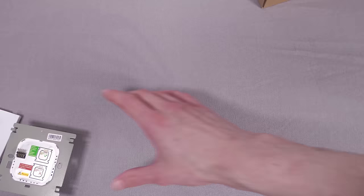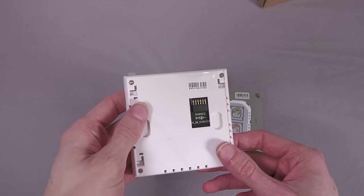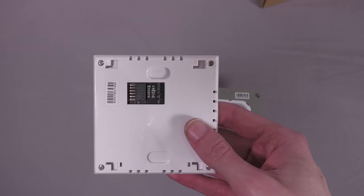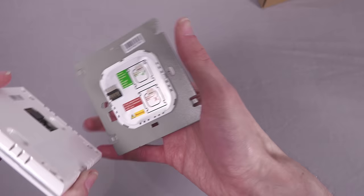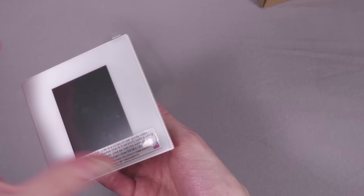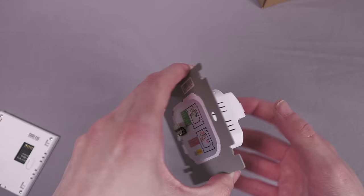Just get a couple of M3.5 screws — the standard screws that would come with any sockets. Don't use the screws it comes with, especially if that box is plastered into a wall and not fun to replace. Now the important part is the switch itself. It comes in two parts: the main screen with a touchscreen on the front, and the back plate which connects via a pin header. You don't need to solder anything — you can actually flash the firmware just by plugging into that pin header.